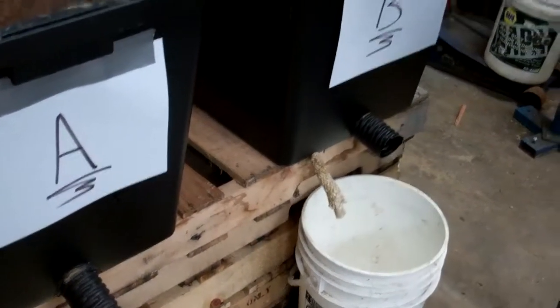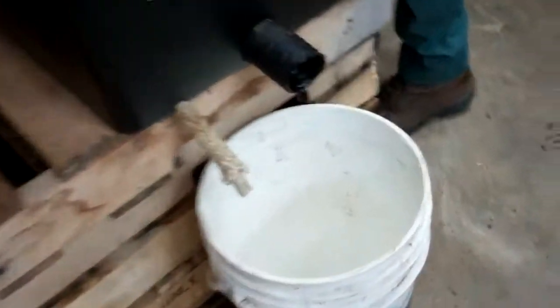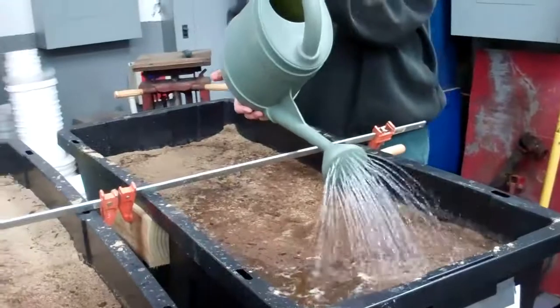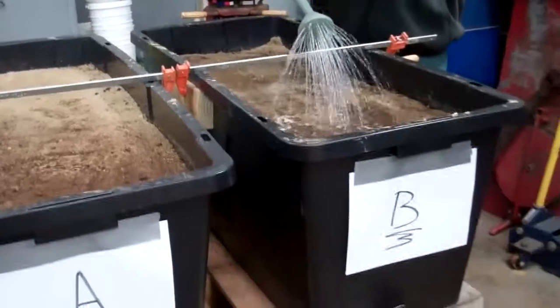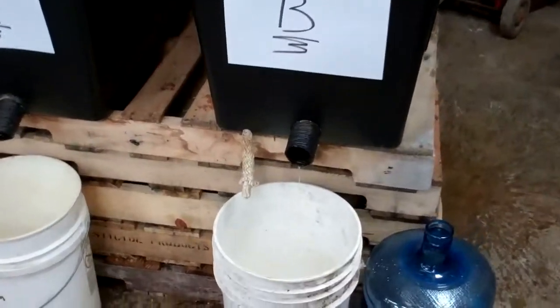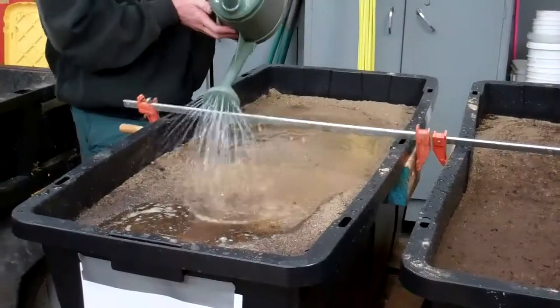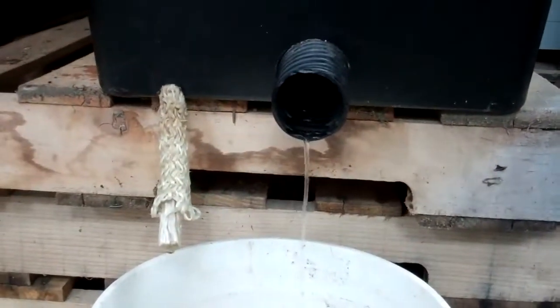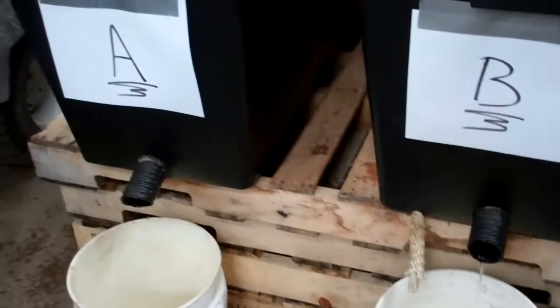After we measure that and when the flow stops, we're going to let it sit overnight and see how much more the rope — you can see it's still dripping — will wick away from the bottom of the perched water table. Applying 5 gallons in this area, it takes a little bit of time to get saturated to the point where it actually starts to flow out of the pipe. It's got to hit that critical state of saturation before it flushes through the pea gravel interface. We also have it on a slight angle using a 2x4, sloping down towards the end of the drain. So let's see how much water comes out through gravitational drainage, measure that, and then measure how much comes out through the rope PC drainage during the overnight hours.